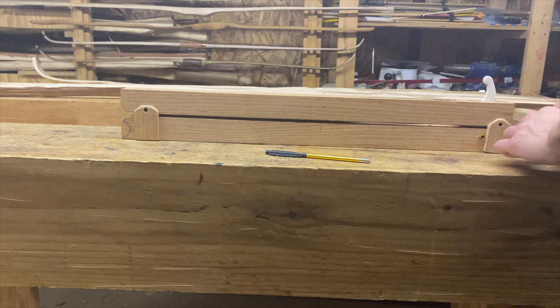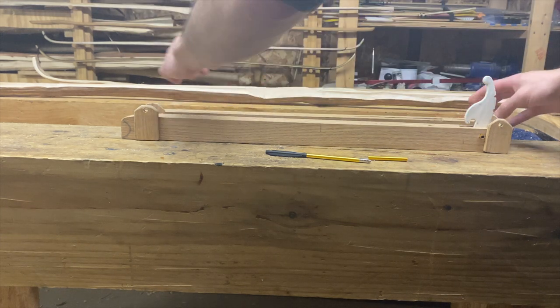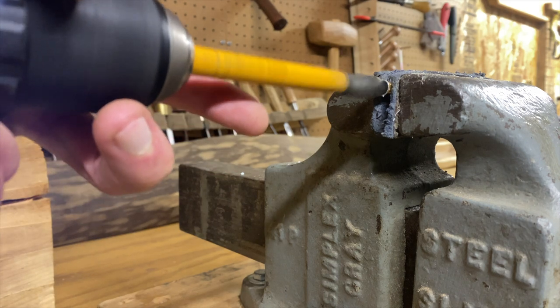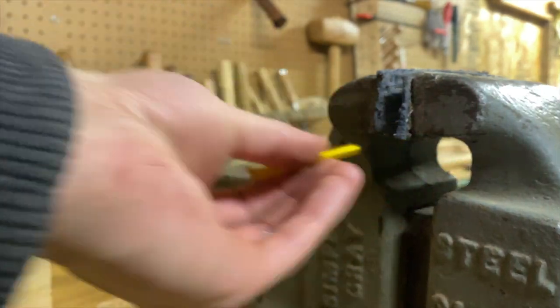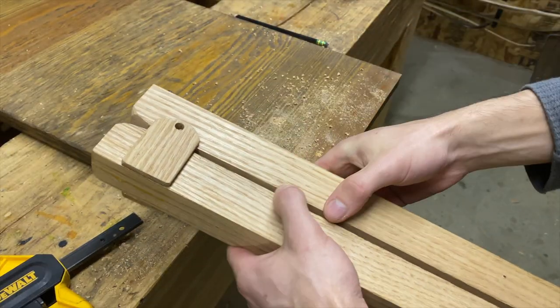The safety pin that goes in the front of the device is just made from a normal bolt, and it's had the edge rounded, that's all. To make the pin that goes in the back, I used the shaft from a broken bolt, and I flared the side out with a drill. Alright, we have the two halves pinned, and the quick release function works.